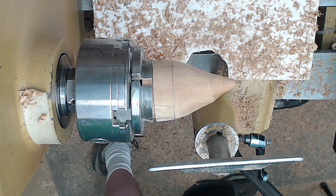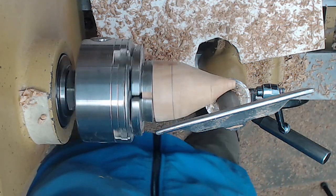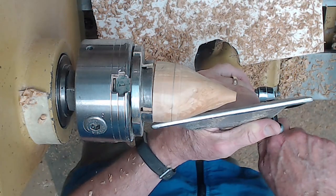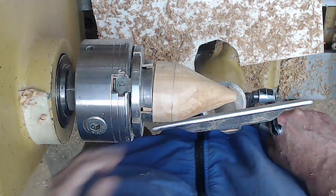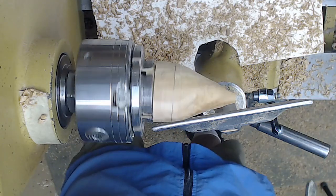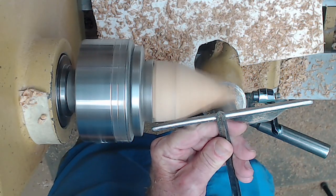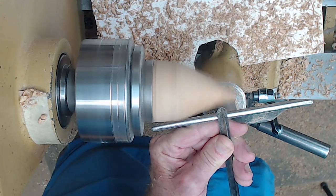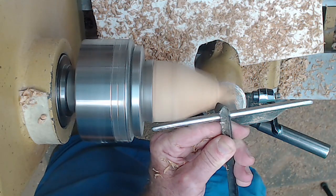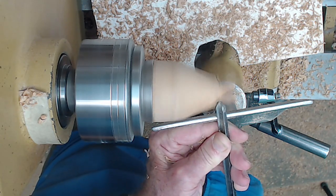So now we're going to get that axis off a little bit. This is kind of a fun project to play with to see what you're going to get. After you lock it in place, you always stop and turn this thing just to make sure that it's not going to hit that tool rest — because that wouldn't be pretty. I'm coming off maybe five-eighths of an inch from the end. Just easing it in. I can see a little bit of a ghost shadow, so I can see where the wood is and don't cut it too far.